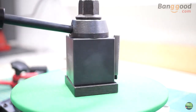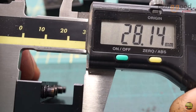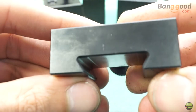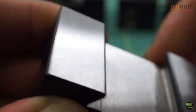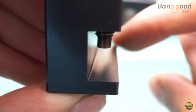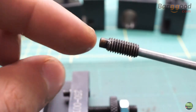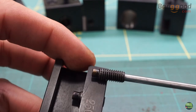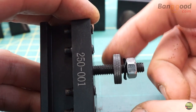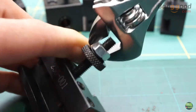Now let's check the different tool holders. The first one is 250-001. It's a basic holder, dimensions about 45x20x28mm. The groove for the tool is about 13mm high and 8.6mm wide. The touching surfaces are really smooth and ground, and every edge is precisely ground as well. The tool groove also looks ground. I'm amazed how they can grind almost every surface for the price of about 13 dollars per holder. For tightening the screw we need a 3mm hex screwdriver, and each screw is turned from the end because the screw tip gets flattened against the clamping surface, so we can still remove it without damaging the thread in the holder. There's also a screw for setting the height — the thread in the stopper nut is cut perpendicular so it runs accurately in center, and it's nicely knurled. The spring washer in the middle works amazingly: if we just slightly tighten the control nut it prevents turning but you can still adjust without a tool, and when tightening, the stopper nut stays in position.